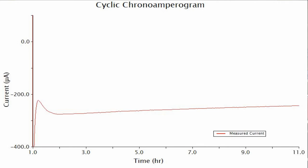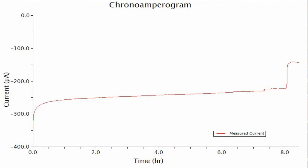And then a third metric is capacity. You can see here that I discharged for 10 hours initially and didn't quite hit the end, and then I discharged for another nine hours and finally was able to see a tailing off as it ran out of juice. That suggests when all is said and done, this cell stored about 18 coulombs.